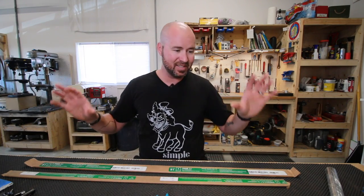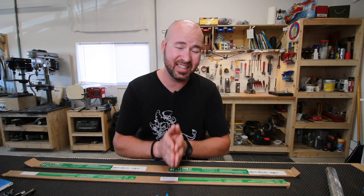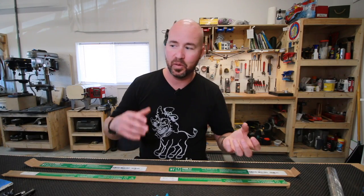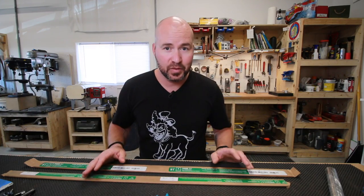So that kind of brings us to the state where we've gone to austenite and then back down to martensite. Now, a lot of stainless steels really benefit from a cryogenic treatment. And this is where you can get into a whole can of worms. Cryogenic treatment. What's a cold treatment? What's a cryo treatment? The shallow cryo, a deep cryo?